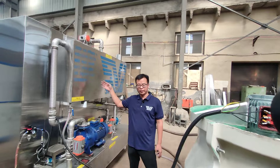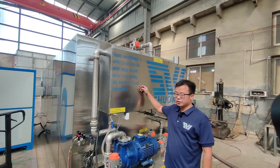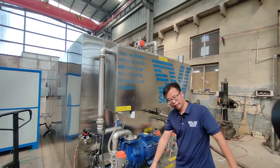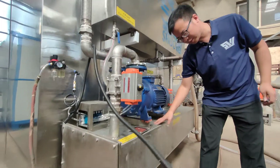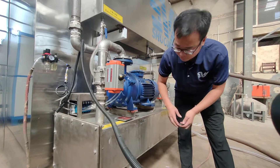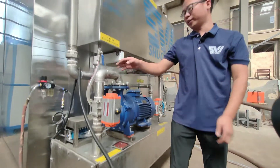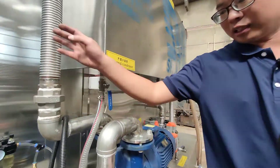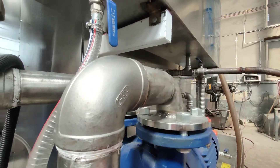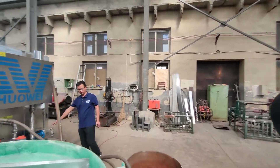Let's go to the back. This is the back of the vacuum chamber. The condenser is stainless steel. And let's see the water collection tank — this tank collects the water from the wood. It is also stainless steel, including the pipings, fittings, and gasketing. All of them are stainless steel 304. And the water circulation pump.